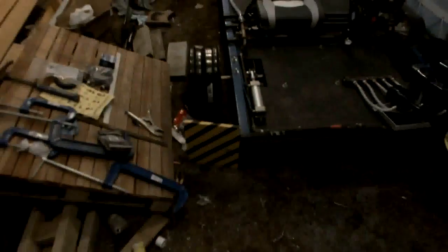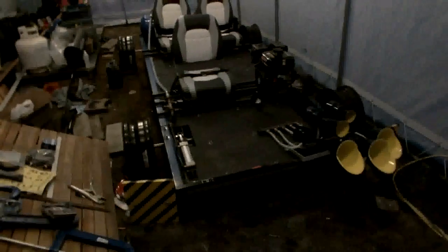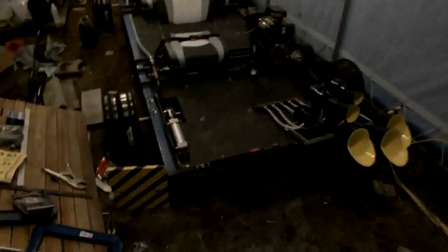So that's the wheels. These plates up here on both sides, they're angled out relative to the rail car, and that is what is called a pilot or a rail guard or a lifeguard, and it knocks things off the rails that would otherwise derail the rail car, like stones or twigs or anything that might be on there. It'll knock them off and keep this from being derailed.